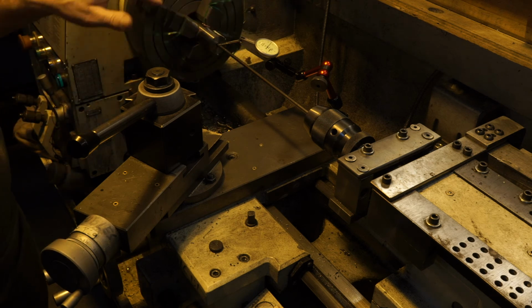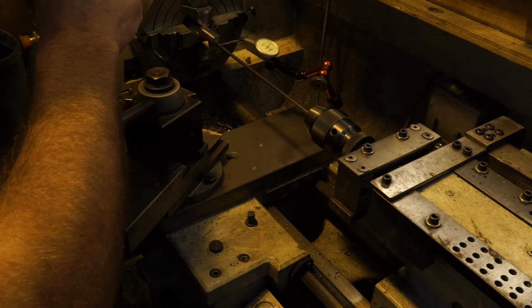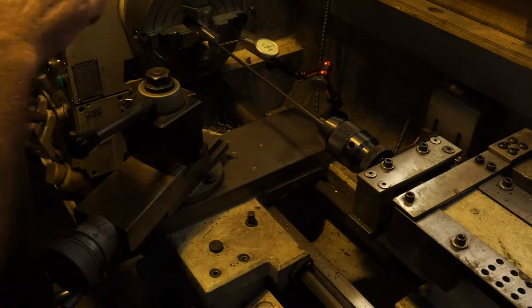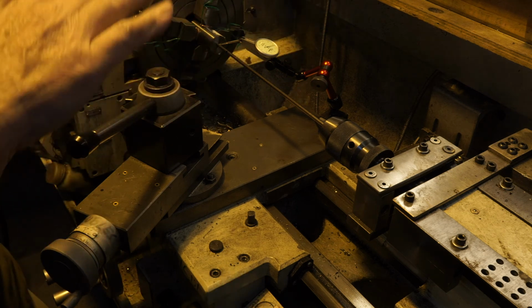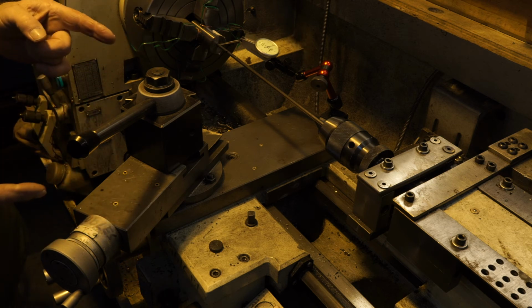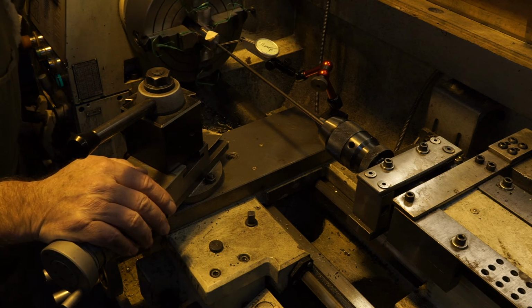Okay, I'm going to call that close enough for now at the pivot point. That's a half a tick on this gauge. Now I'm going to go out here, an inch away. See, now we have the classic, perfect wobble up and down. Now, here's where it would be kind of neat to have a camera on both the inboard and the outboard so you could see that rocking motion, but instead I am going to run this to a side right there, and I'm going to go out here and loosen this finger tightness out here and adjust it out.